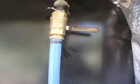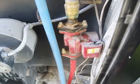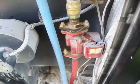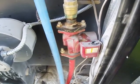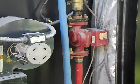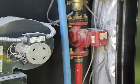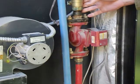Now, you will notice when I unbolt the pump that I'm going to lose the water from here down to here — that's in that blue line. It'll gurgle back through the system, but that's okay, it's not enough water to matter. Okay, so I've got the power turned off and the valves on supply and return are closed.